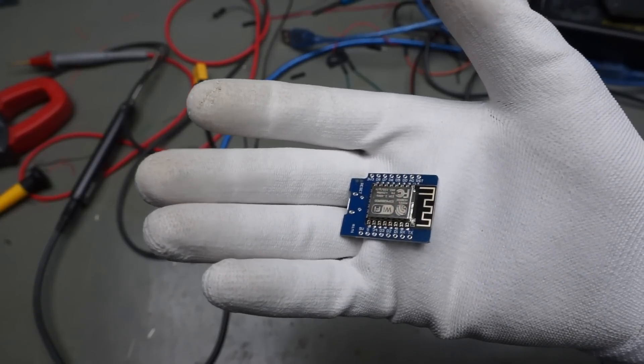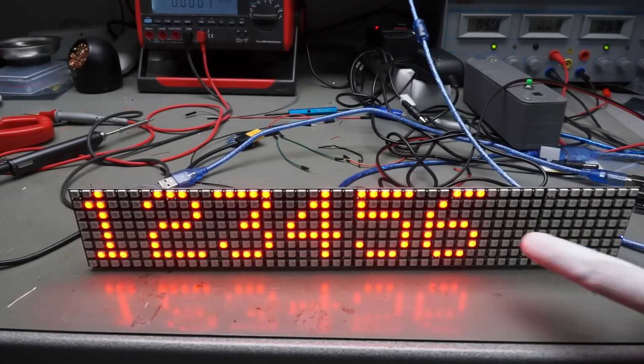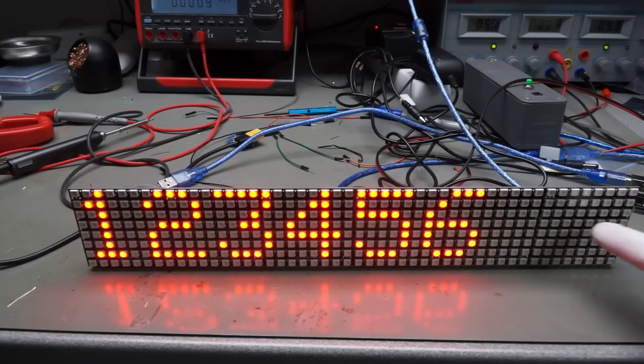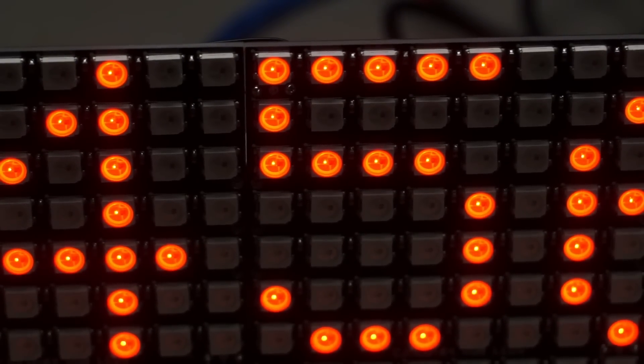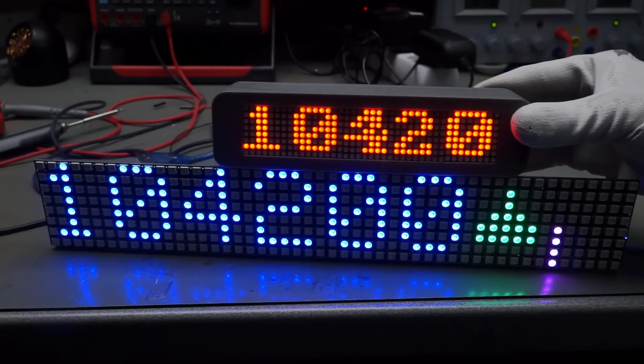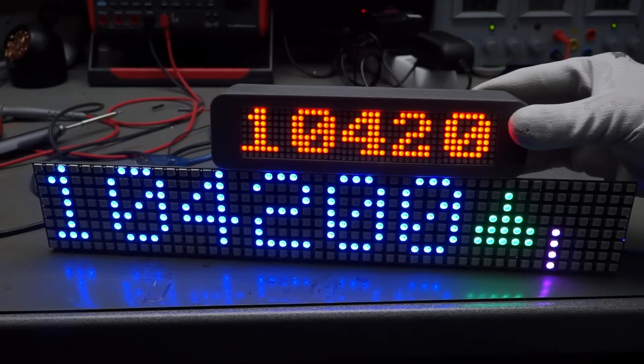For such projects I prefer a WEMOS D1 Mini because it is very compact. The first tests show that everything works, but one part of the display is not used for my six digits. Tip or trick nine: it is shorter than you think. The font used by the Adafruit library is only 6x8, not 8x8 as the one used in my last counter. This means I could have just changed the font of my old counter — software can sometimes replace hardware. Anyway, it looks better than the old one and represents the new era in my YouTuber life.